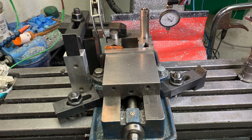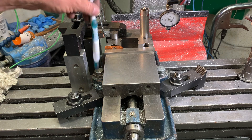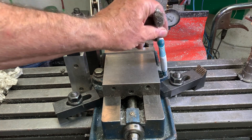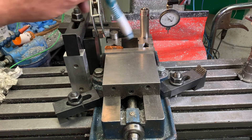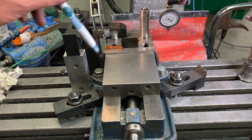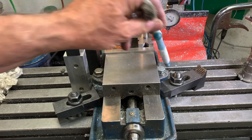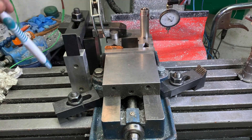So I was playing around with this idea and I'd like to show it to you. First of all, the fundamental problem with clamping the vise — you see the hold-down nuts here — when they press down, the surface has to be dead flat. So I've machined those flat, because if you don't do that when you tighten this down it'll shift the vise. That's step number one, and I've actually made some special washers there to make it a little better.